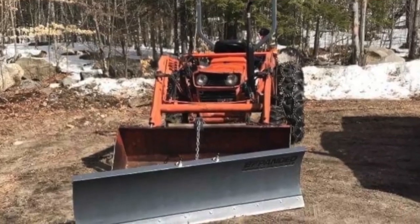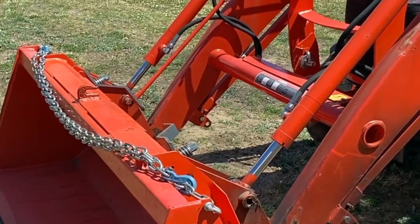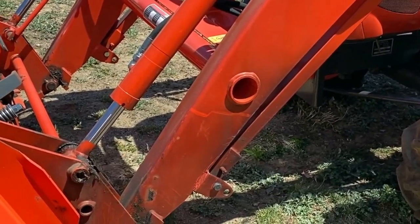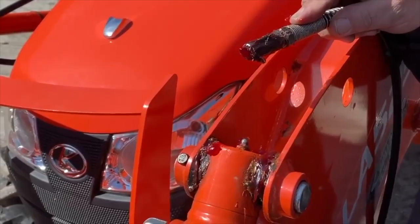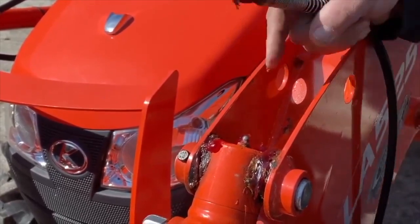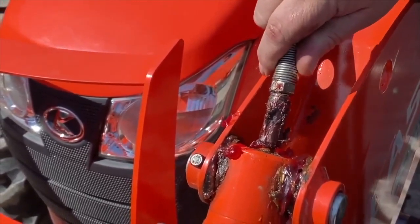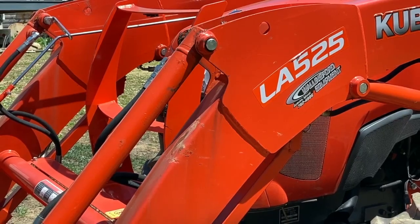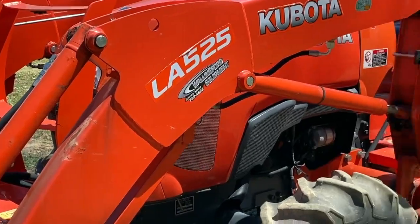These are all things I did on our old tractor too, so they were ideas I had before. As you can see, when I say this tractor gets used — we've got the obvious exhaust stains, and you can see the machine gets greased with a lot of grease coming out around the fittings and joints. I try to grease the machine about every ten hours of use just like the manual says, but there are times when I run it for five hours when it gets ten hours worth of use, so you have to use your best judgment. Never let them go dry — unless it's something with a seal, over-greasing isn't going to hurt. These pins you can grease to your heart's content.